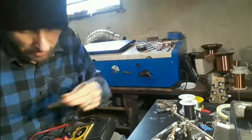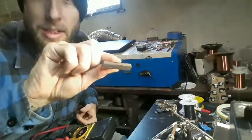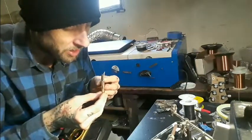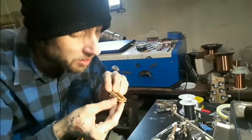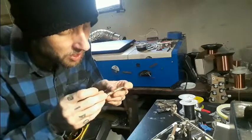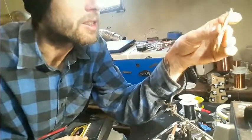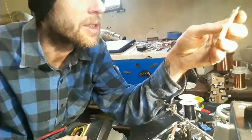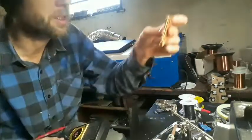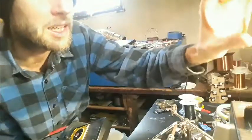Here's the magnet — popped right out there. It's hard to say what size this is. I think that is — I don't think that's coil wire that I'm seeing. I think there's like a jumper going to it. I can try to put this in the coil estimator and figure it out. It's maybe 43. It's pretty small. I think if it's 44, it would be a little bit higher than that, even as small as this is.